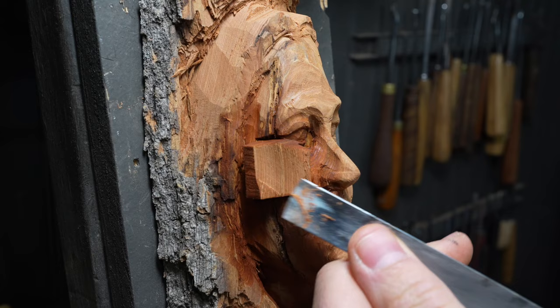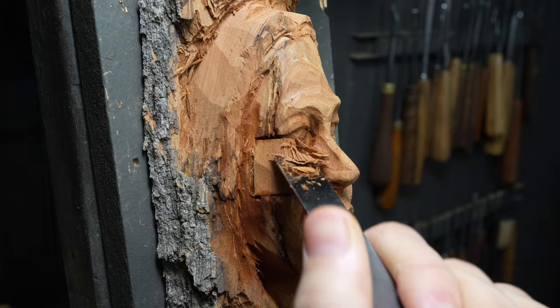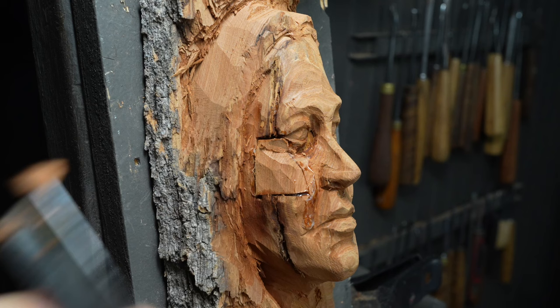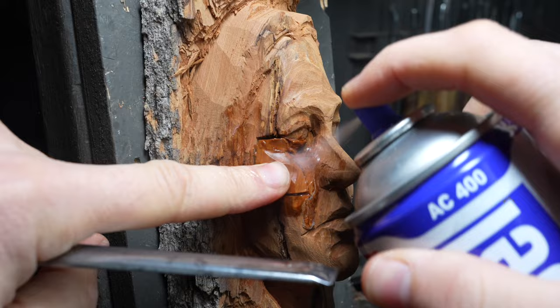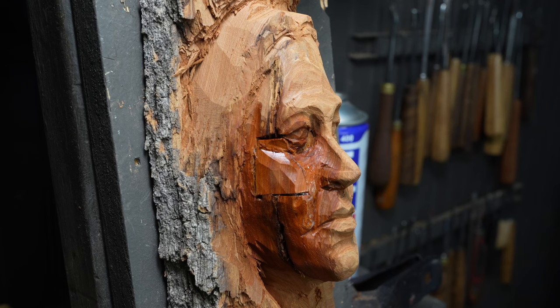Now I'm just going to start to pare this back using whatever gouge you have. You'll notice there are some gaps here, which is okay. It looks like we've exposed some more undried glue, so I'm going to apply light pressure and spray it with accelerant once again. Now this is a great opportunity to use the fill technique. I'm going to grab some 120 grit sandpaper.